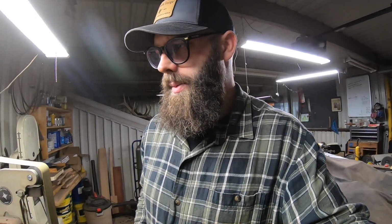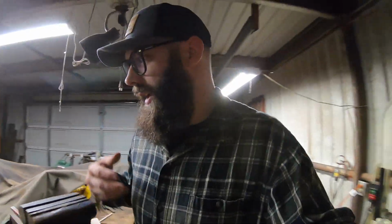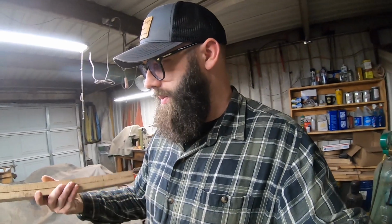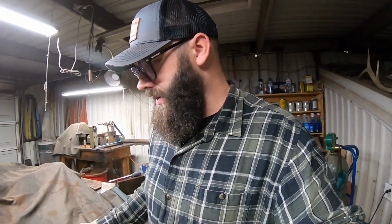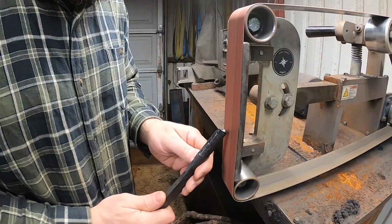It's not a big one, but the people that know how to use a wood lathe mentioned that a gouge is good for roughing out material on a wood lathe. So I reforged that. I just have to put an edge on it, and then assuming that we can safely stick this between the centers, I want to go ahead and try to get this turned now. So I thought I'd bring you guys along on that and see what we can do here, and hopefully not break anything.